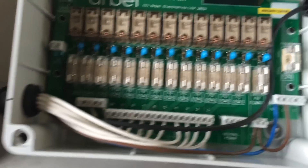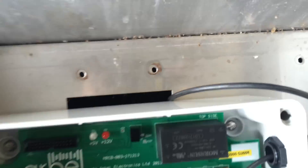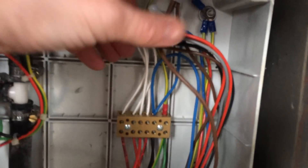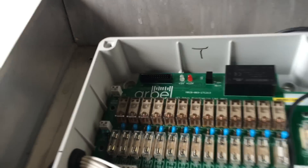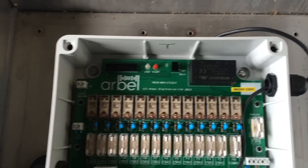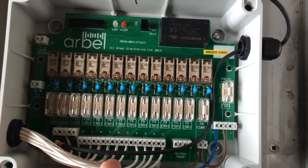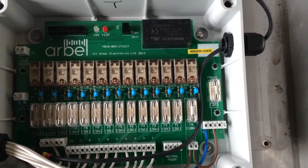Right, we've got all the wires made off in there and the probe running. Luckily there was a bit of a gap, so we've got them all joined up in here. That'll all tidy up with some cable ties. The recommended thing is to power it up like this and nothing should happen. Then if that's okay, you put the top panel on, power it up again, then you can test all your outputs in test mode to make sure you've got the right relay with the right cable. And then once you've done that, you can put the computer on it and program it a bit more if you want to.